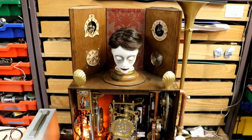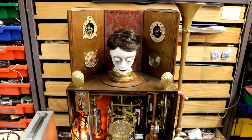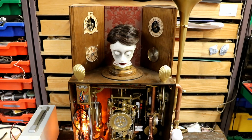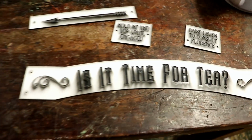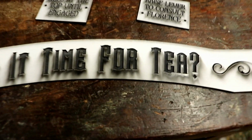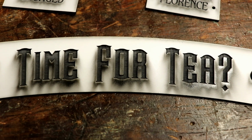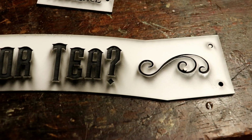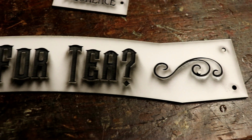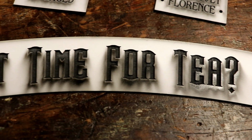Starting to feel a bit of trepidation as I'm coming to the end of building Florence, as I've been doing it for about 3 or 4 months. So, last few jobs. The engravings have come out, and as you can see, there's lots of soot around them. When you cut acrylic, you don't get any soot, it just melts through. Get a slight smell. But this engraving laminate must be made of something else, because it burns slightly differently, it cuts, and you do get this soot.